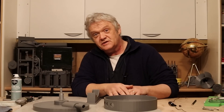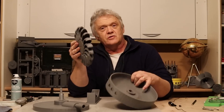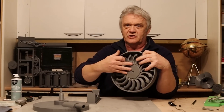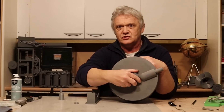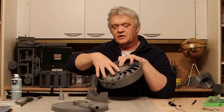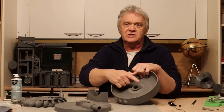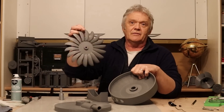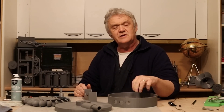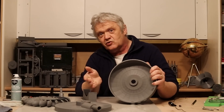The heart of this device is pretty straightforward — really just these five bits. We've got the turbine, which slots into the housing, then the housing top, and there's a foot that acts as a drain, lining up with those three holes. All we need to do is put some bearings in here and a piece of 8mm rod. These are 608 bearings: 7mm deep, 8mm centre, and 22mm wide.